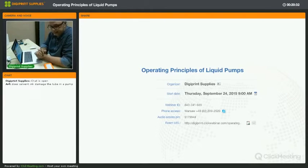Sooner or later, yes. Solvent ink, of course you use solvent resistant tubing, but it's resistant, you know? It's not like it's totally immune to solvent. So over time, solvent will always degrade the tubing inside a pump, whether it's Tygon or Norpren. Norpren will last longer, that's for sure. We tested that multiple times, and also in the field we see that Norpren lasts longer than any other solvent-resistant tubing. But in the end, yes, it will be degrading.